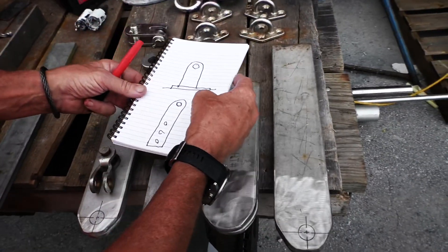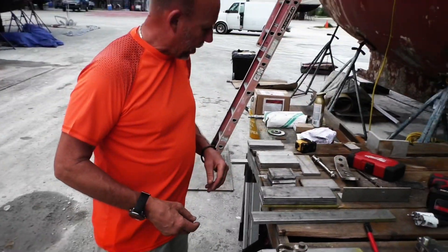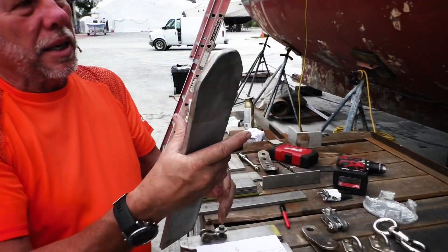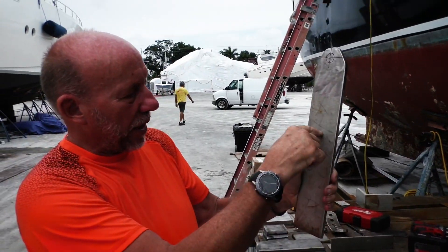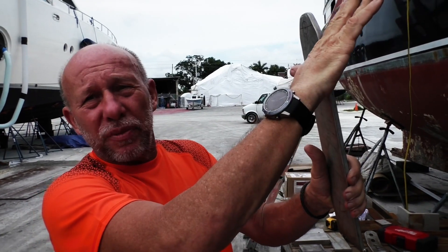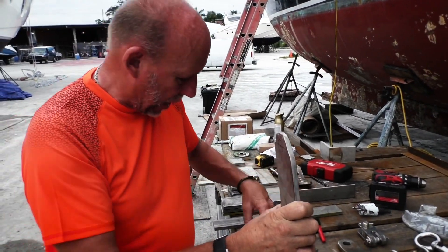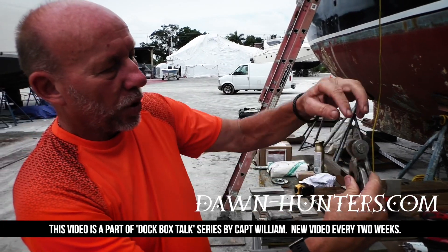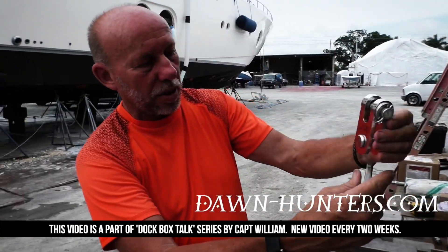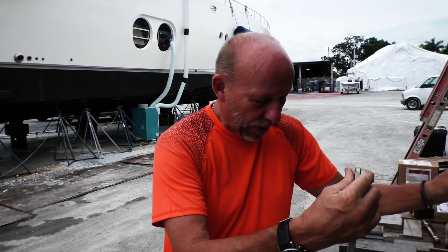A little bit like the sketch, only inverted — typically you're going to have a chain plate. In this case, let's pull one out. This would have multiple holes that would bolt through the hull. This would then be bent at a specific angle, and attached to this would be a turnbuckle, which would then attach to a stay. There are multiple types of turnbuckles with different designs and styles. We'll go over that later.